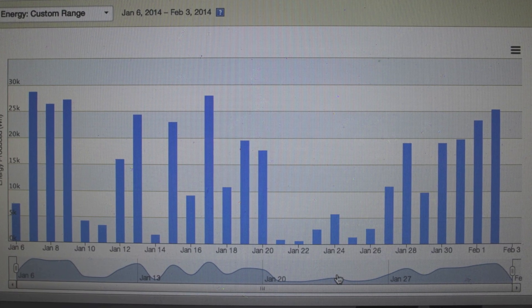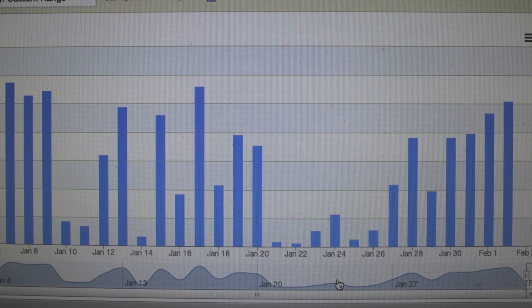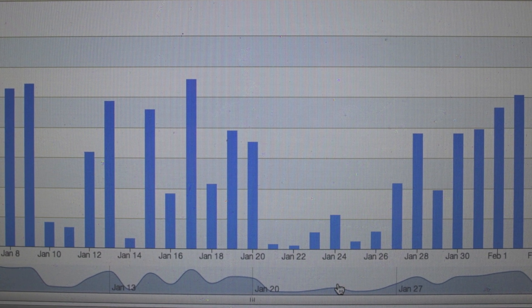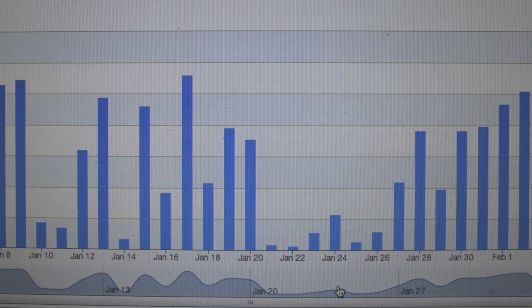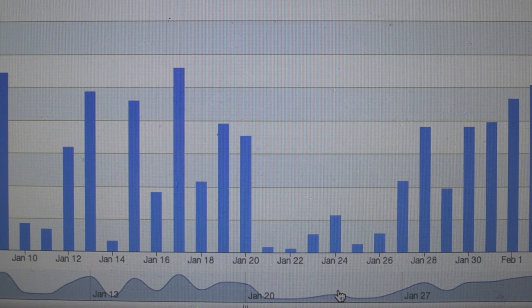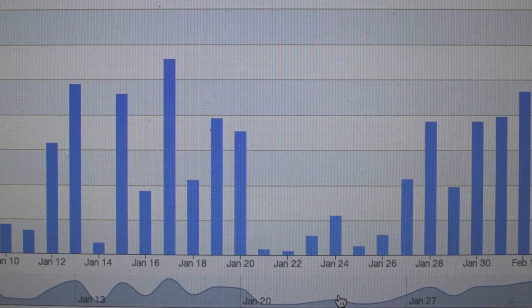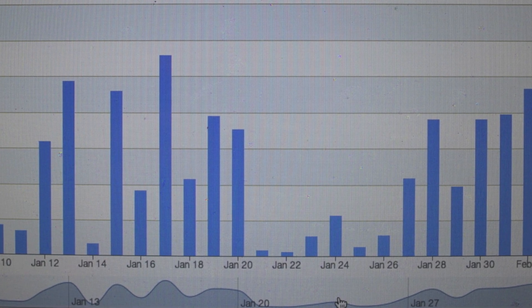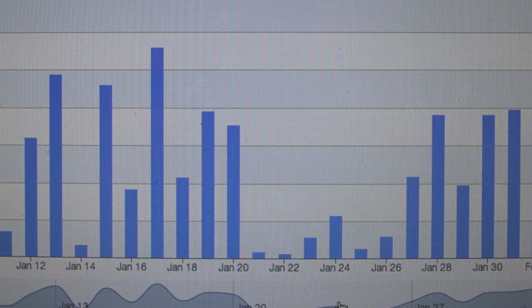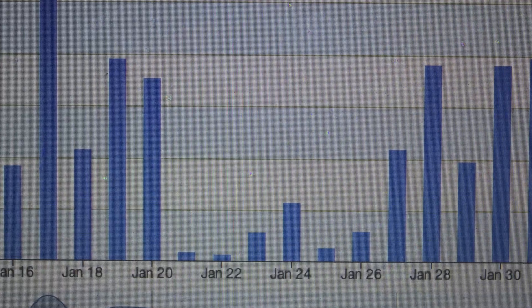So is it worth your time and effort to clear snow off your panels? Here is the last 30 days of production during the winter of this 12.6 kW system. The best-case scenario is about 30 kWh per day. You'll notice there are two sections where there is limited production — one lasted about two days, and one is about six. If we assume the loss on any given day after snow, at best-case scenario, is about 20 to 25, maybe 30 kWh for the day, at 18 cents a kWh, that's anywhere from $3.60 to $5.40 per day loss.